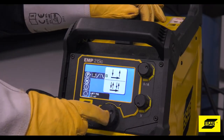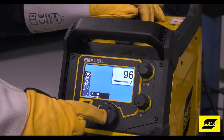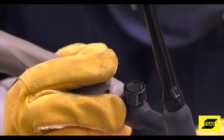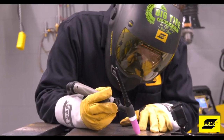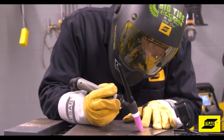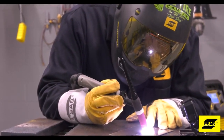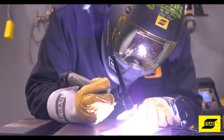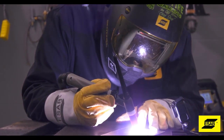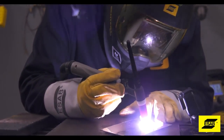The machine has two options for using the LIFT arc TIG torch: four-step and two-step trigger. On two-step, you have to hold the button on the torch while you are welding. Four-step is a little more complicated — you touch the tungsten to the work piece, press the button and break contact. This creates a small 5-amp flashlight arc so you can move the torch into position. You then let go of the button and the machine will slope up to your welding amperage so you can begin to weld. Press the button again and the machine will down slope to finish out the weld.